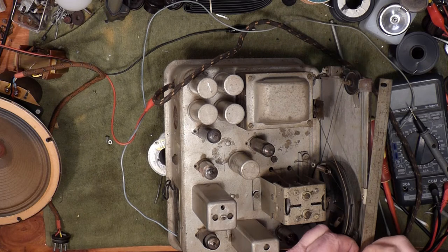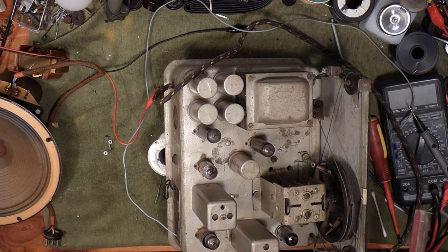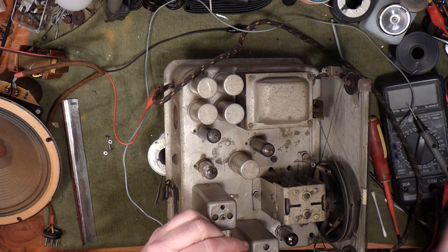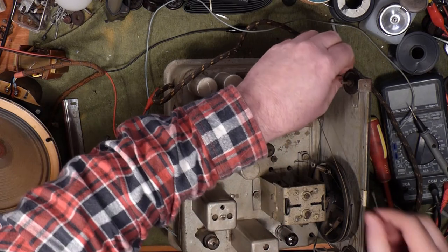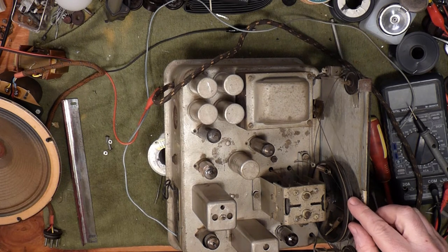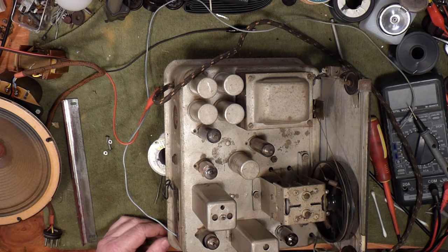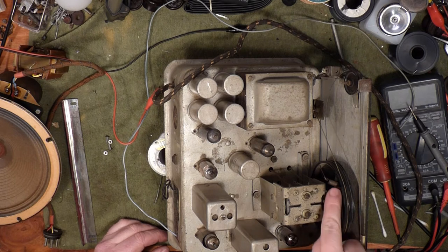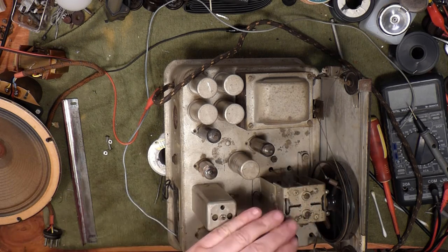This is just the part of the dial that keeps the light from spilling out the top - there's some flocking on there. We'll give this a bit of a clean and a bit of oil while we're at it, as it is a wee bit draggy. The dial cord's coming from where the spring's mounted, out and around the drum, up over this pulley, along here, around this pulley, and then no doubt down underneath, back up to the hole, and back into the spring.